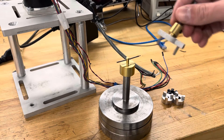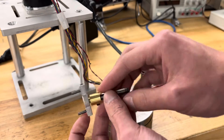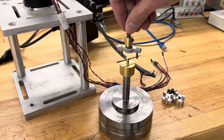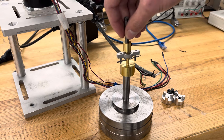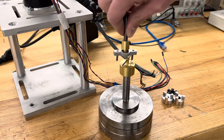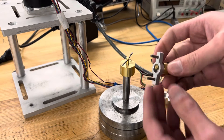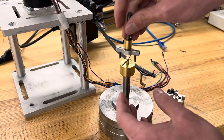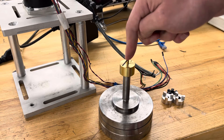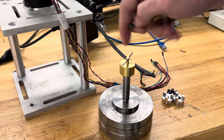So here's the solution. This is a really neat kind of coupling where you have a pin going through the shaft — this is your motor shaft here — and you have this floating dog with two drive pieces. You put that on, it bears against the drive bar, and you can turn it like this. It's a bit hard to show at this small diameter, but you get the idea.